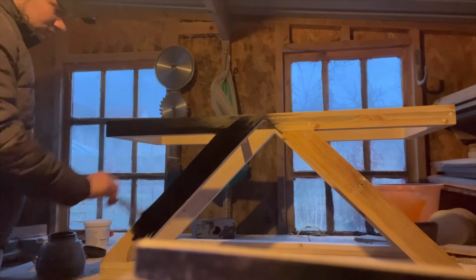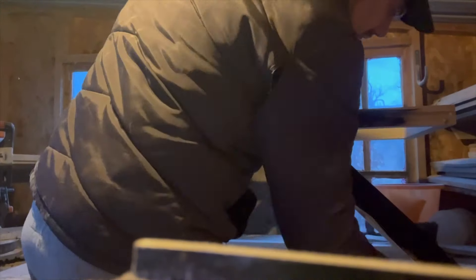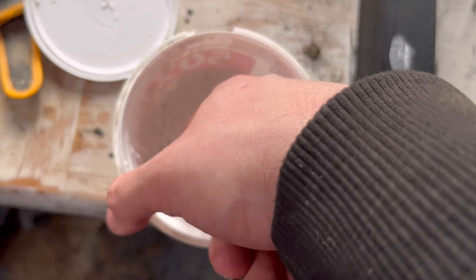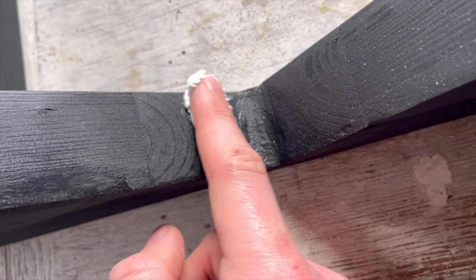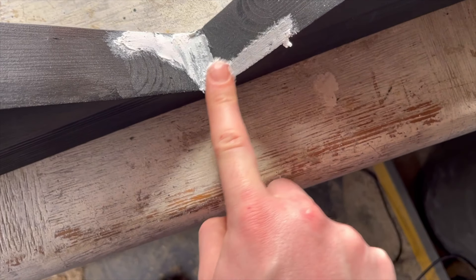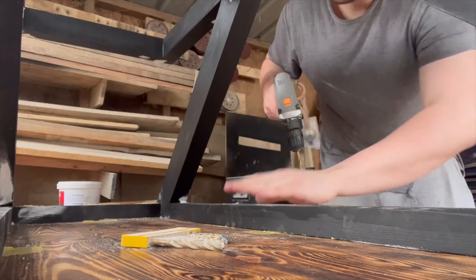Here I am just painting the table just to double-check there are no marks or anything I've missed, because it's always when I paint the table that I notice an imperfection and have to go back and re-sand it. I thought I'd try to beat the system this time — paint it, see what all the imperfections are before I've already sanded it up to 400 grit, and then I can go in, make all those corrections and I'm fine.